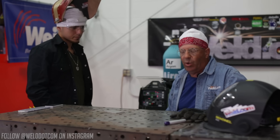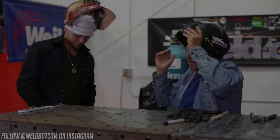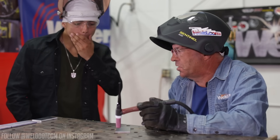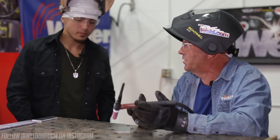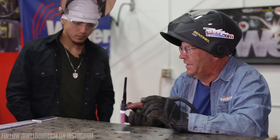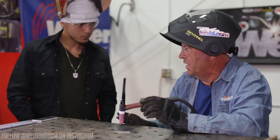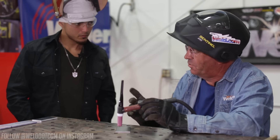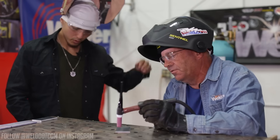I'll make that point go away as we show some different effects. First thing - we've got about an eighth-inch clip here and I've just very lightly brushed it. I'm not trying to super clean the oxide layer off because part of this demonstration is so you can see what's going on with the AC arc and the cleaning effect. So again, we're at 120 Hz and 30% cleaning action. Let's watch this.